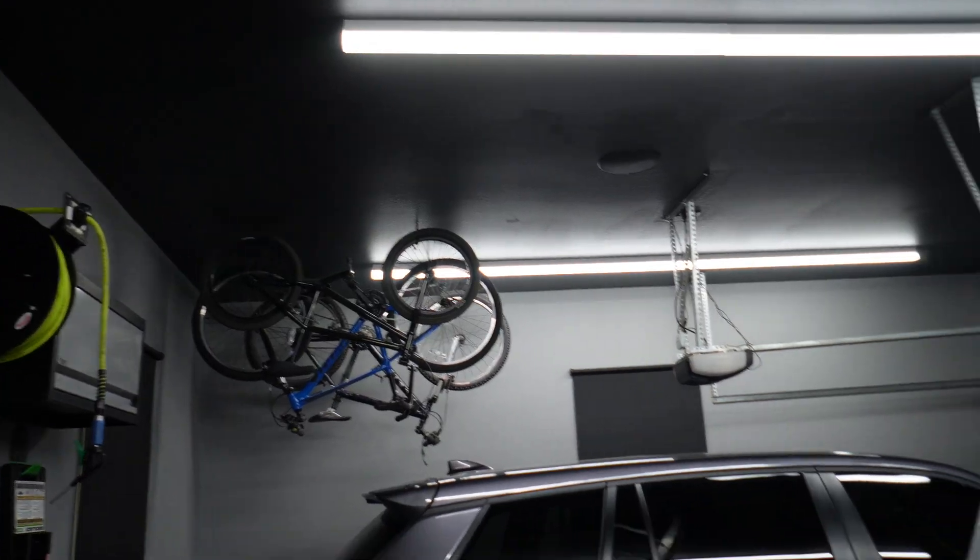If you're not familiar with what that is, I have these Cree lights — they're linear fixtures called LS fixtures, and I have four of them: a 12-footer, 16-foot, 12 and 12. These are more of a commercial style light, which means they use something called zero-to-10 volt dimming.